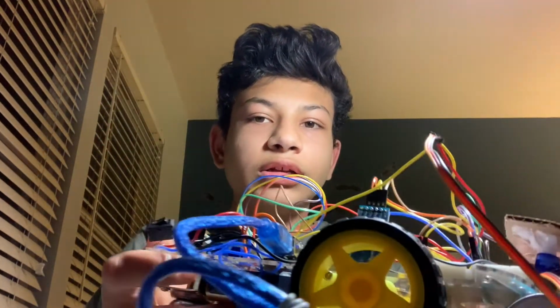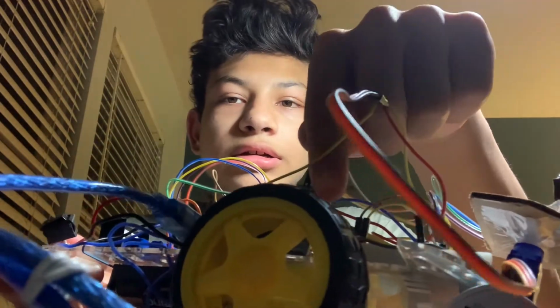And so the first step in doing this was to add a Bluetooth module to my car, seen right here. And what this does is it essentially allows me to communicate with the phone and the Arduino simultaneously. It acts as a middleman, I guess. And after this, the electrical component of this modification was done. I didn't need to do anything else to my car to mess with it, which is good because it's easier to mess around with code instead of the actual circuits, because those are the ones that are hard to fix.